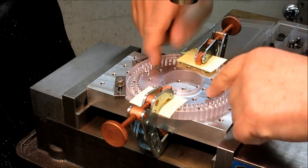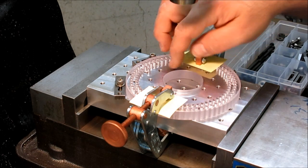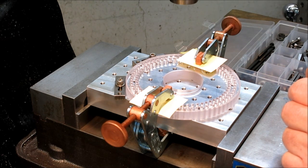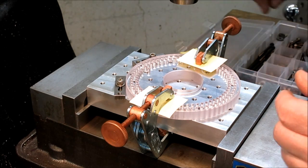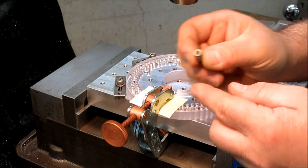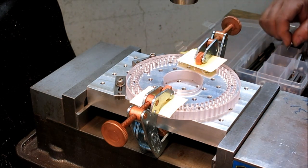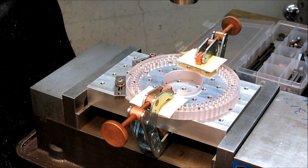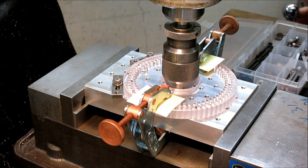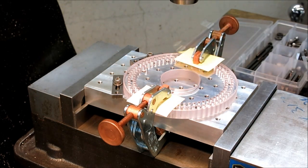Okay, so that's as secure as I need it to be to put a little pattern of holes around the center. It's just a three-hole pattern to mount the disc. Anyway, boom, quick and simple. You're on, you're off and going in a couple of minutes. You can also just use these low head socket heads here. I use those for stops sometimes too when I need a thin stop while I'm working on the little pallet plates here. So yeah, then let me just drop in, say hello, and kind of get lined up there, doing the eyeball centric, and now I'll indicate that, and off we go.